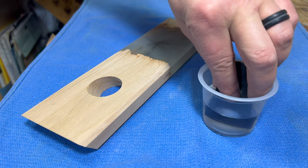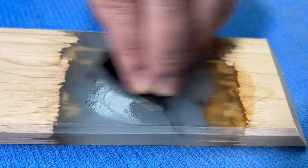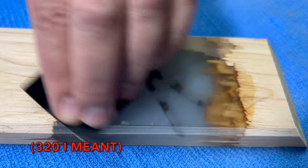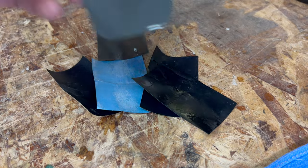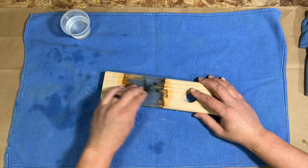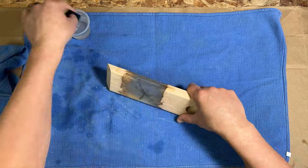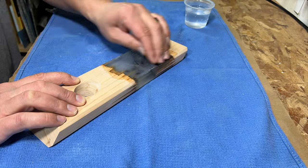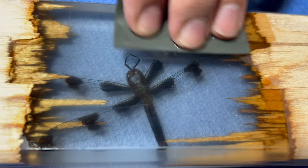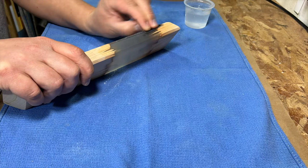Now for the part that I dread. After sanding with the random orbital to 220 grit, I start wet sanding with 300 grit, working to 400, 600, 800, 1000, 1200, 1500, and 2000. With each grit, the clarity improves slowly, refining the scratches towards a polish, and you get a sharper image of what is within. You want to make absolutely sure that you get all the scratches out from the previous grit before working forwards, or you'll end up working backwards. And it takes forever, especially if you're doing a few of these.